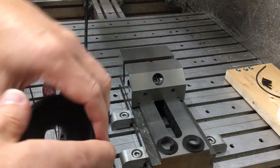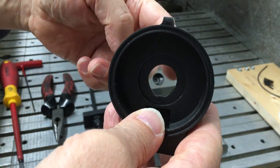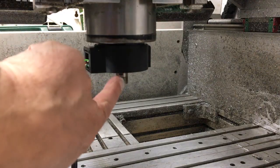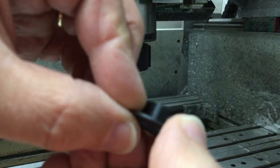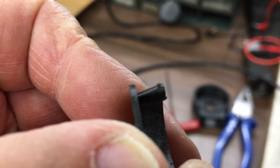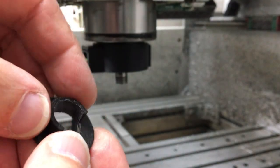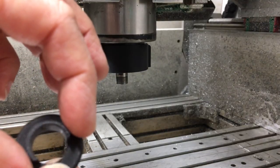While I was doing this I wondered if some of the light was bouncing up and wasn't shutting off properly, so I had different depths of this side wall. It looks very similar to before but there's a much bigger hole in there. The centre disc is a different design - it's a bit narrower and these side bits here are currently 90 degrees to the base, but on that one they're angled in so when the LED shines on it, it's angled down, stopping light going up and hitting the locking nut that's silver and reflective. This little hat is a little bit smaller and there's a different thickness here as well to take up the extra gap.